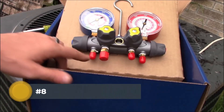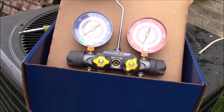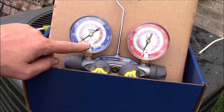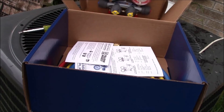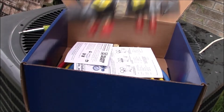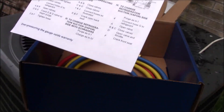The rugged steel case is built from polycarbonate crystals with easy-to-read three and three-eighth inch color-coded gauges. The forged brass body adds to its reliability and durability, ensuring a long lifespan. This gauge has sliding double O-ring pistons that effectively provide sustainability against daily wear and tear. The full porting feature improves capacity and flow. Enhanced features include 60-inch plus two hoses with standard 1/4-inch flare color-coded fittings, with an 800 psi working pressure and 4000 psi burst pressure.